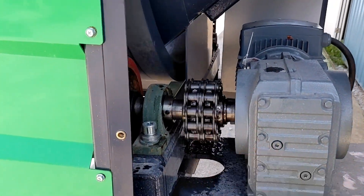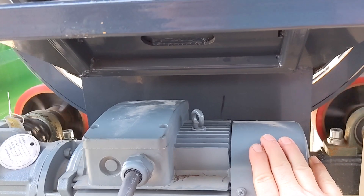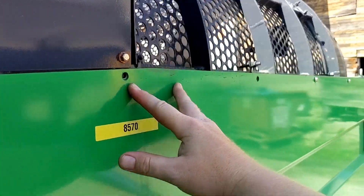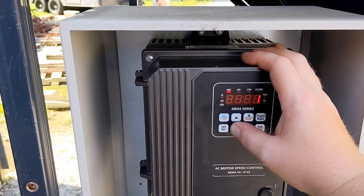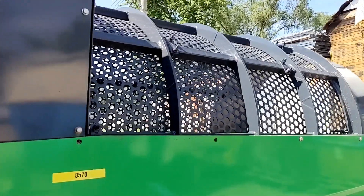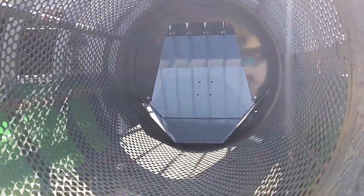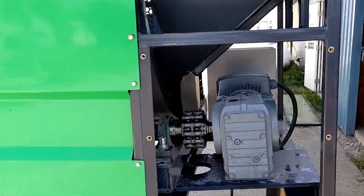Oiled up this chain here because it's never going to get oiled again — put my best foot forward. It's kind of a rattle trap; it's got sheet metal here that's loose — that's what that rattle is. They just never put bolts in or they vibrated out. We're not going to run it that fast. Go back down to 100. That's 100 RPM on the motor, but that is relative because then you go into a gear reduction — so if it's 5 to 1, obviously you're spinning slower. But you can really fine tune it with the VFD, and that is a good idea for this.